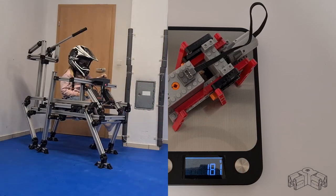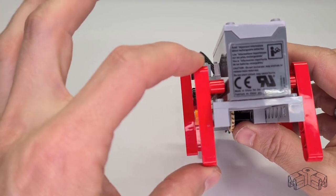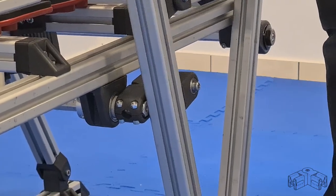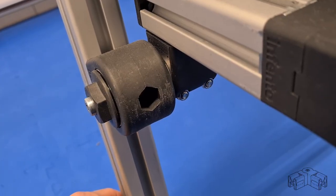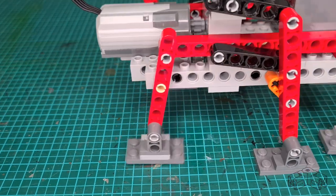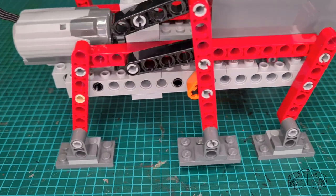The Infento Walker is not only 10 times bigger, but more than 400 times heavier than its LEGO counterpart. The LEGO Walker has friction and a lot of backlash in its joints, but this doesn't matter as there is almost no load to carry. On the Infento Walker it does matter, and I had to make sure to use side-by-side hinges only where they were inevitable. Can you see that the foot of the LEGO AT-TE Walker is sliding a bit over the desk surface? No problem for the LEGO Walker, but a big problem for the Infento Walker.